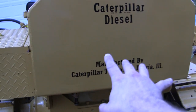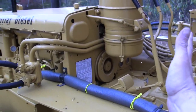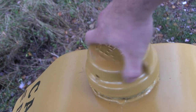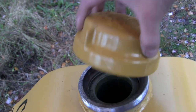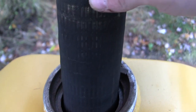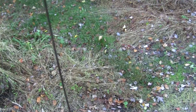There are two types of seats on these machines. This one has the fuel tank built in. There is an earlier type where the fuel tank would have been mounted on the side fender with a slightly different seat design — both were utilized during World War II. To top off the diesel fuel you undo this cap, and inside we have a filter to strain out any particulate found in the diesel fuel. To check how much fuel you have, there is yet another dipstick.